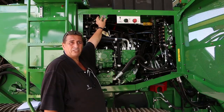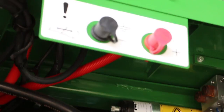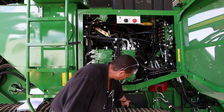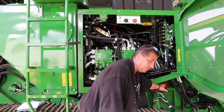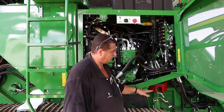Some other things to look for: there's an isolated battery switch. When jump-starting your machine, don't jump directly off your battery — always use your jump start points here. Something that new guys may have trouble finding is your engine drain hose and your main drive pump drain hose — they're hidden up here tucked away. Down here you'll see there's a sight glass for the base cutter unit; the fill point for that is just underneath this flap. Safety: when you do any work on your base cutters with the machine jacked up, please pull the pins out and slot these down — that will stop the machine coming down on top of you. Vitally important that you follow the safety rules.